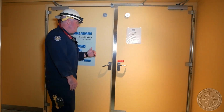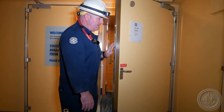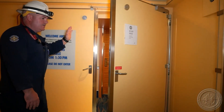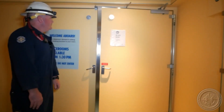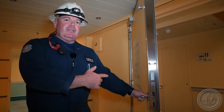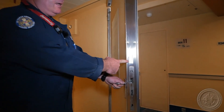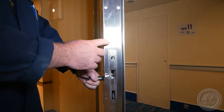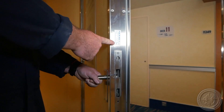If you come across a fire door that is already closed and you need to test it, all you do is open it all the way to fully open, let the door go, and watch it close completely and latch. When looking at fire doors, you also want to find their label plate. For domestic vessels this isn't a requirement, but for international vessels the door has to be labeled with what type of door it is. This one is an A-60 door in an A-60 boundary.